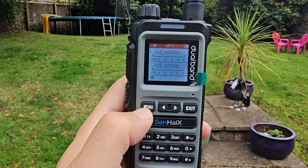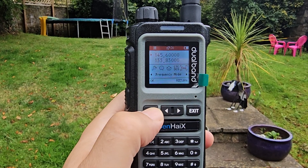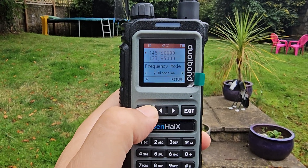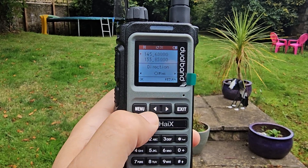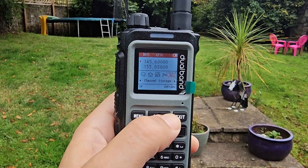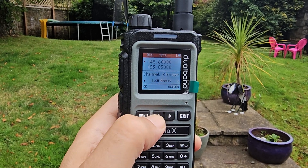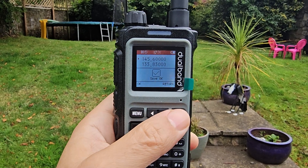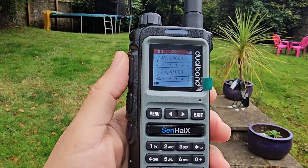There it is — exit. A and B band: just press the exit button, which goes up and down. On the A band, press menu and go across until it says frequency mode, go right, and then you can do your shift — up or down, go plus. Then to add a memory channel, exit and keep going to the right to channel storage, choose your channel, memory first, then choose the channel, and store it. It's literally that easy.